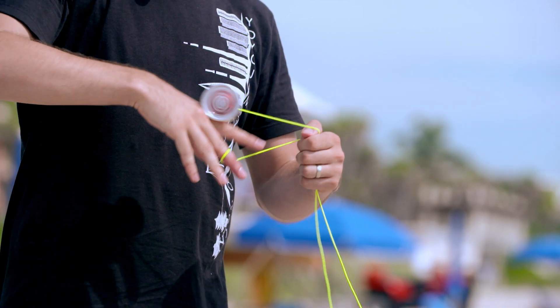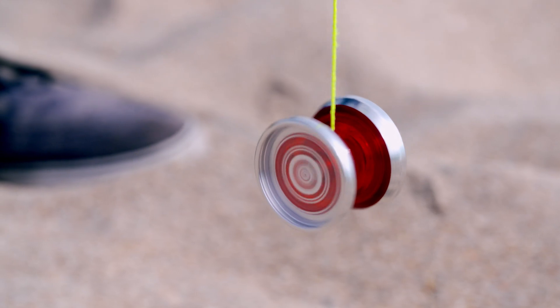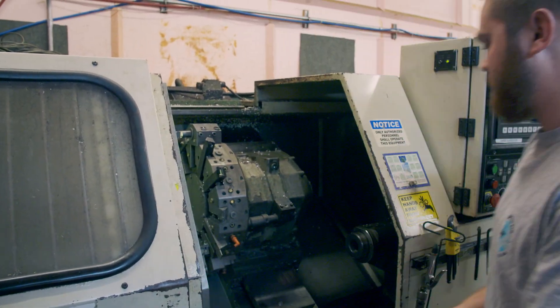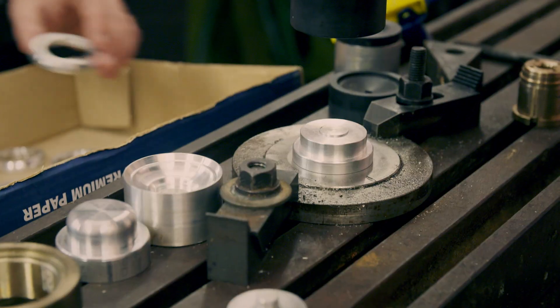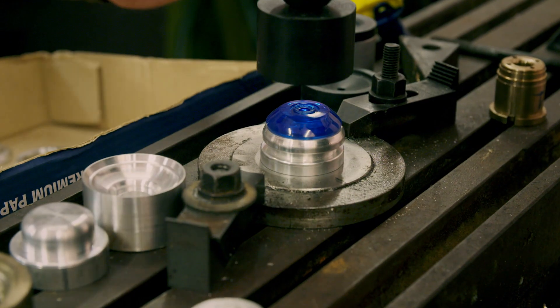To generate even more spin, workers add extra weight to each half. The heavier the yo-yo, the longer it takes to slow down. These are for the outside of the yo-yo to give it more weight for a stronger spin and better play. Peter uses aircraft-grade aluminium to sculpt special metal rims. They must be accurate to one tenth of a gram so the finished yo-yo spins true. If they don't fit snug enough, the yo-yo could be out of balance, and the slight weight difference on one end could throw it off.